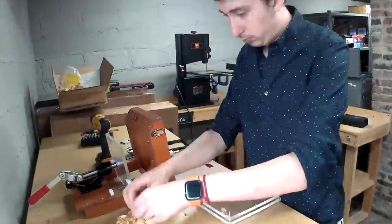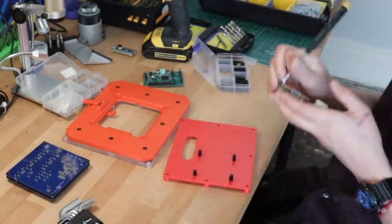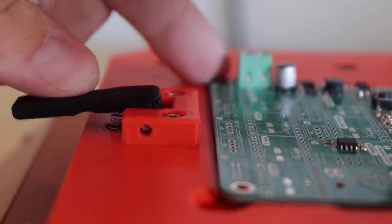After the frame was all put together, it was time to start adding our own custom parts to it. The jig that we bought is just a platform — it's not designed with any board-specific stuff. Mainly the parts just need to make sure the motherboard is held really securely and can be pushed into the pogo pin board repeatably and accurately. Lucian designed a print that goes on the bottom platen to hold the motherboard in place, a carrier for the controller and the Raspberry Pi, and even a little ejector lever to make it easier to remove the board.